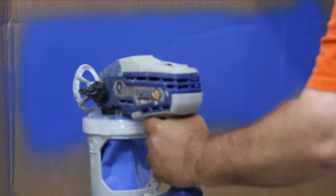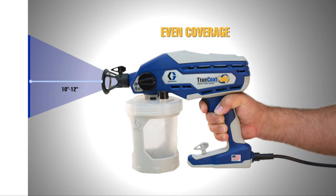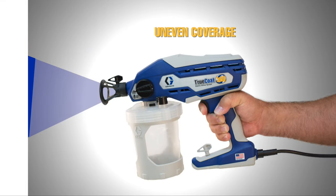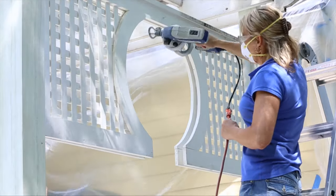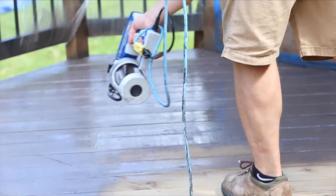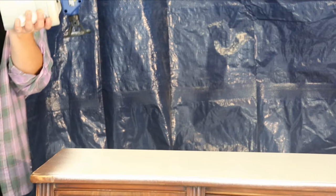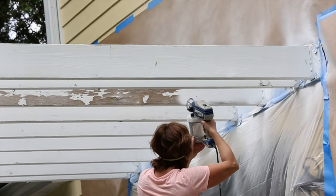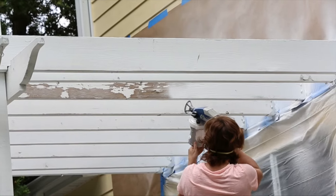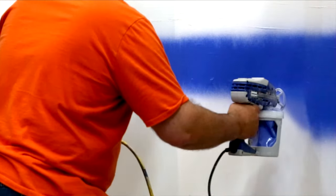Use a piece of scrap cardboard to practice these basic spraying techniques before you begin spraying a surface. Hold the sprayer 10 to 12 inches from the surface and aim straight at the surface — tilting the sprayer causes an uneven finish. Flex your wrist to keep the sprayer pointed straight at the surface you are spraying, as fanning the sprayer results in an uneven finish. The speed at which you move the sprayer will affect the spray finish. If the spray pattern is pulsating, you are moving too fast — slow down or turn the speed control to high. If the material drips, you are moving too slow — speed up to create consistent, even coverage. Pull the trigger after starting a spray pass and release the trigger before the end of the spray pass.